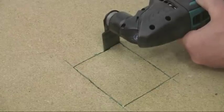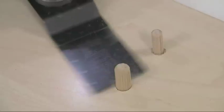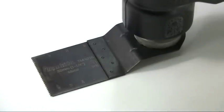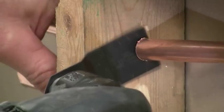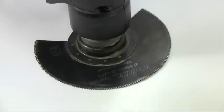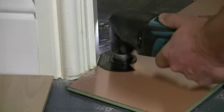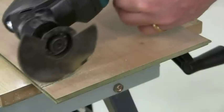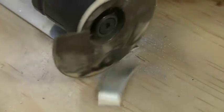So it's perfect for cut-outs in floor boards and decking, and you can also use it for flush cutting — for instance, dowels and tenons. The B21412 is another plunge cutting blade, but this works really well on non-ferrous metals like thin profiles and pipes, and also for cutting access holes in plasterboard. Another useful blade is the B21325, and this is perfect for cutting door architraves and skirting, as for instance when you want to install laminate flooring. They also cut a variety of man-made panel materials like the laminate itself, and small non-ferrous metal sections.